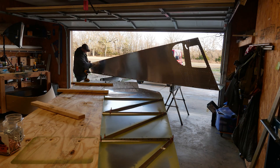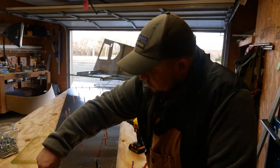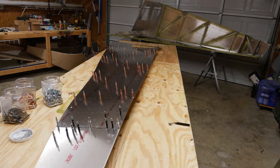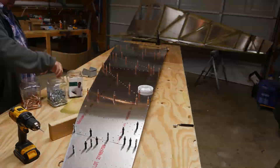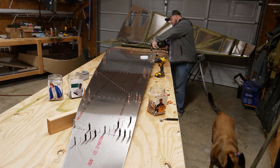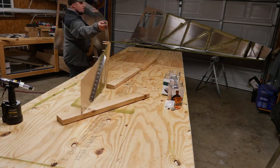There's something else I needed to show you — you're going to drill that out with the number 20 bit because they're A5 rivets. Go to the horizontal frame piece in the back for the horizontal stabilizer bulkhead. Make sure you go with your silvers first like you saw on mine, then when you flip this over, take your clecos out from the bottom and drill it, then do your final rivets. You can see I'm getting everything final riveted — it's just like the bottom. Put your sides on, cleco in place on the longeron, and you can even final rivet the bottom if you'd like. I'm going to wait till I get the top done.